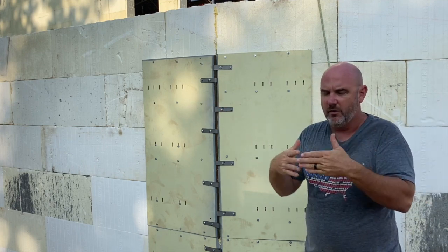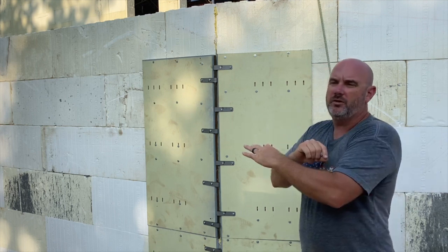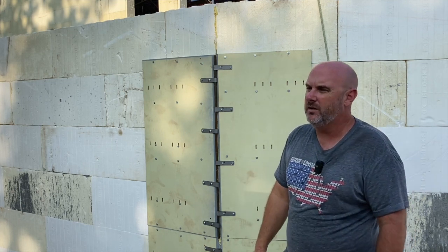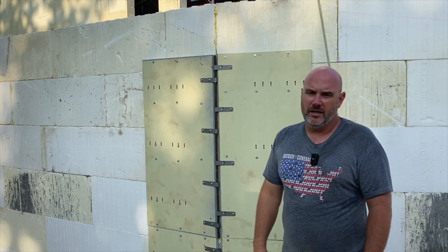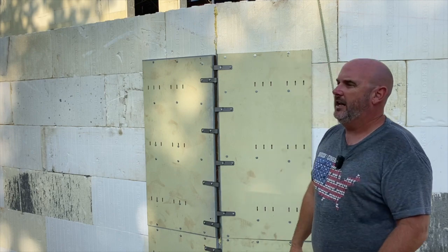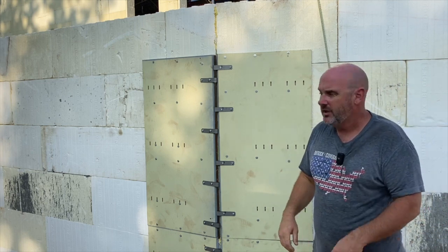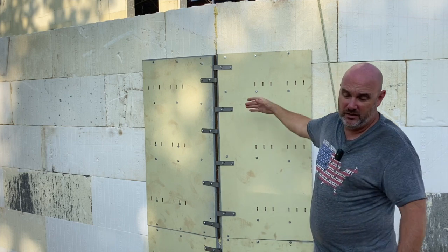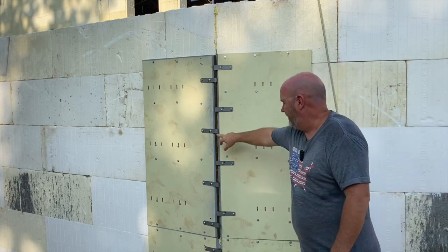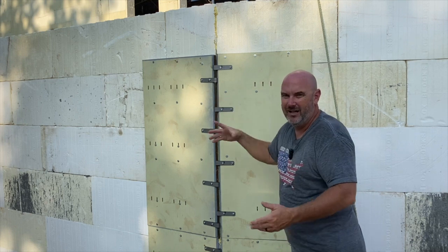Because they don't come with corners, it's like a bastard joint in a house where you have to sew things up, but at a corner it's more difficult to screw across them. So we'd end up putting plywood on both sides of the corner and running Simpson metal strapping around it. The first couple of times my Amish guys handled it and I didn't realize how tedious it was until I was down in Dolphin building pools without them — there's like 100-plus screws per corner. That's a real waste of time. My brain went back to Gates cam locks and whaler tie forms, which are really robust. This corner form is made to hold back 12 inches of concrete 15 feet high on its own. All we use it for is that nice hinge — fold it to whatever angle the corner is, screw it to the webs, and we're done. Five minutes instead of an hour.